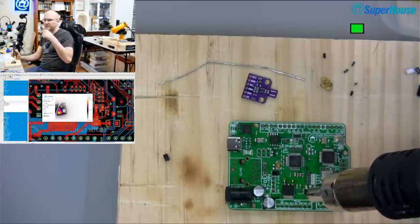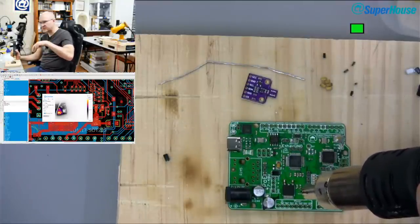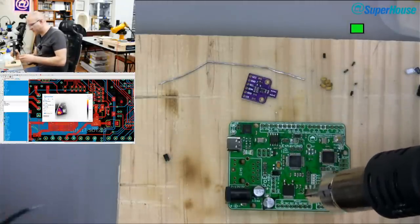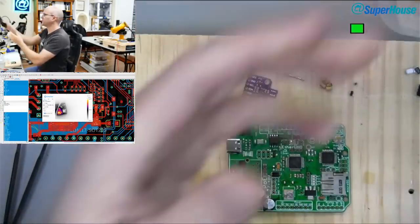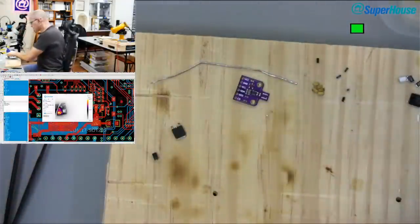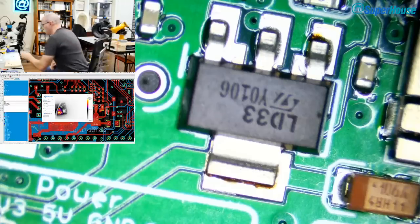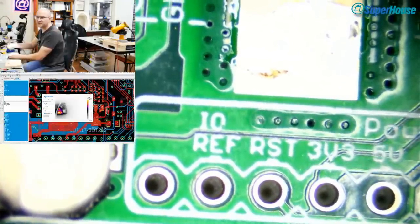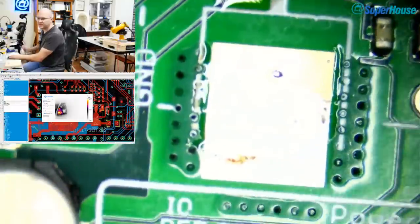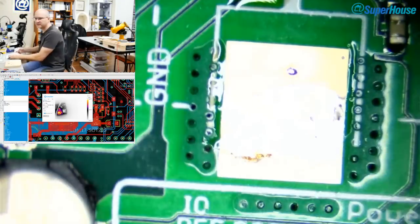It's so that if the voltage regulator is trying to dissipate heat, that heat goes out through the vias to the bottom of the PCB. And there are like 30 or 40 vias right next to it. Oh, there it goes. It's come off. Which help to wick that heat down. In fact, you can probably see them if I chuck it under the microscope while the board is cooling down, because I want to let the board cool down for a moment before I connect power again, because if we use the thermal camera to see what's going on, it's no good if the board is still stinking hot from being reflowed. So you can see here the vias that are used for thermal and electrical stitching.